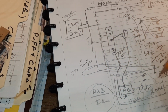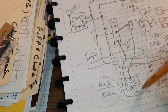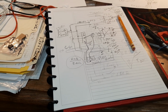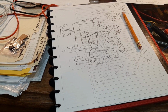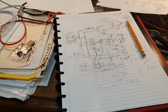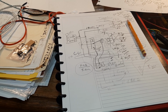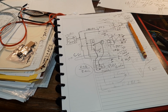Then bring this guy in, bright light, give him the 5 volts, and see if he can trigger the relay. So I've got to run that test and this test, and then I can say, this is how it's going to work, and it won't affect the motor, it won't affect the motor controller, and it'll be reliable. That's the game plan. Then I'll build test boards, and once I've got it figured out, I can build a PC board like I did for the Puff and Chuff, and that will organize those parts a little more, and hopefully I will find a spot in the tender somewhere, somehow.